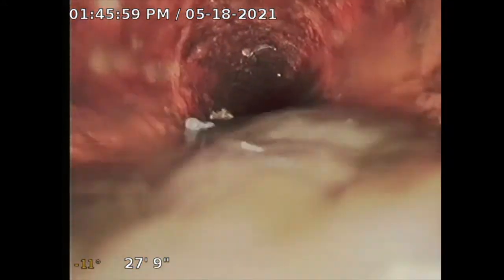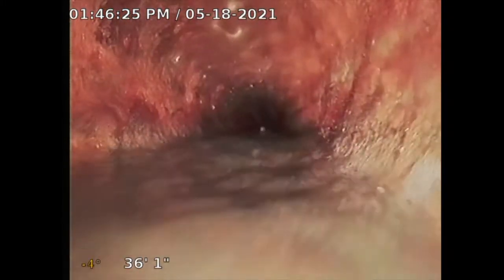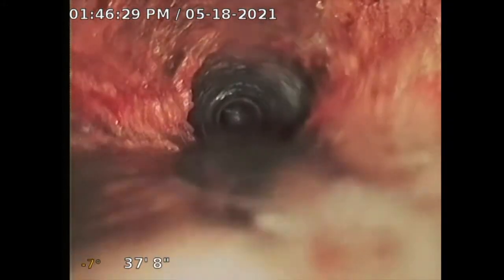Now we're cooking — it's looking a little bit better, I'm flowing. My camera's traveling, 30 feet out. This is probably underneath the house going to the front of the driveway — the house faces north, so I'm heading north. Typical corrosion, age-related. Now I'm getting out to the driveway area — I appear to be in the driveway area. Now it transitions to clay. There's nothing wrong with clay — clay is a good pipe, lasts for many years.